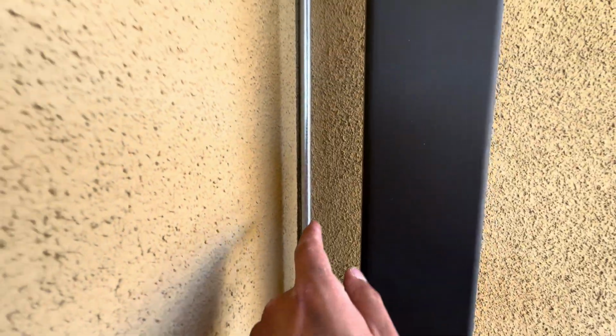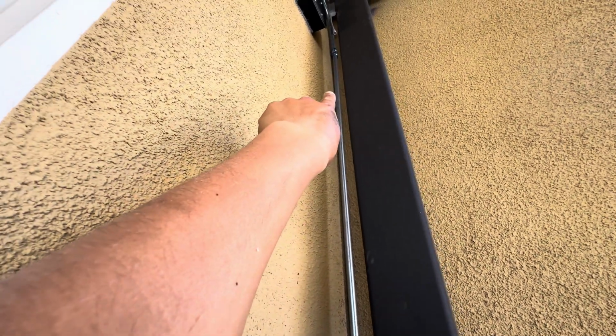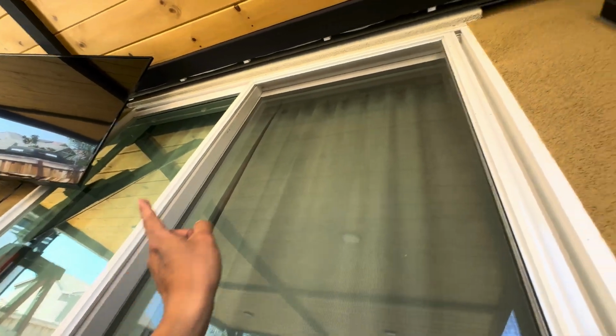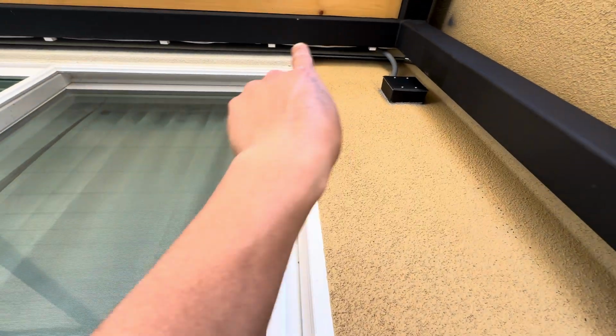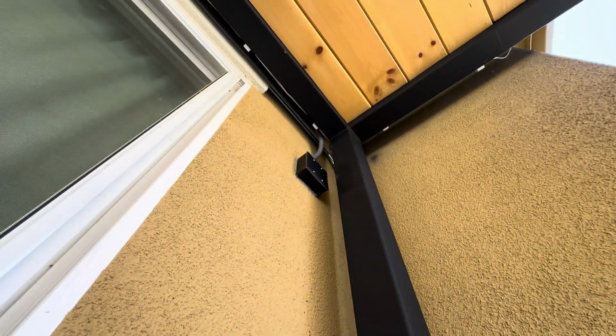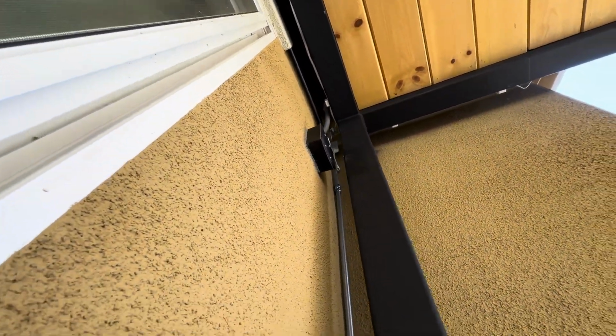So I went and added a strap. You want to add a strap within 3 feet of your J box, and intervals of 10 feet. I'm just gonna add another one within the same tube right before the coupler, and then add one on that side. I can't really add any up there, but it's resting on the trim piece. I know that's not okay, but I can't squeeze my hands in there.